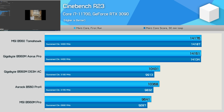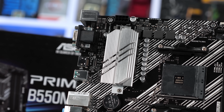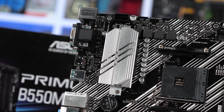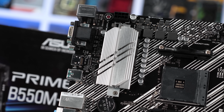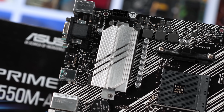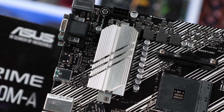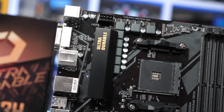Some viewers claim that this really wasn't as shocking as I'd made it out to be, and in fact, this wasn't even an Intel-only issue, claiming entry-level AMD B550 motherboards also suffer from big performance losses with higher-end CPUs. Now, I already knew, at least for the most part, that this claim wasn't accurate, as I've tested VRM performance of roughly 30 AMD B550 motherboards, and none throttled using the Ryzen 9 3950X, a 16-core 32-thread processor.